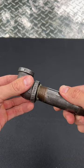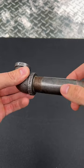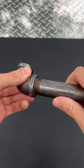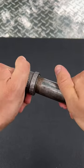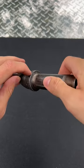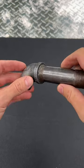Take it running into the fitting. Once we tighten this up by hand and let it set for a second, the pipe vice thread sealant is going to seal all on its own. No need to over-tighten or crank this down super tight. Obviously tighten to the specifications of the job at hand, but just know that the pipe vice thread sealant is going to create a seal by itself without the need to over-tighten. Super awesome stuff.